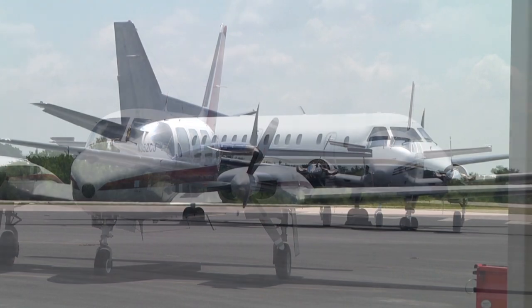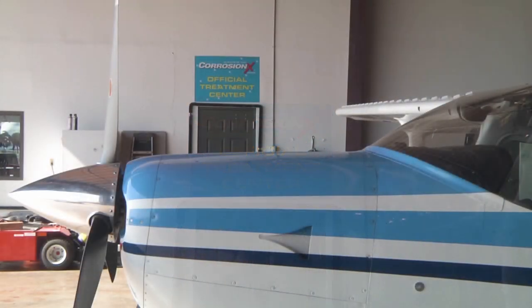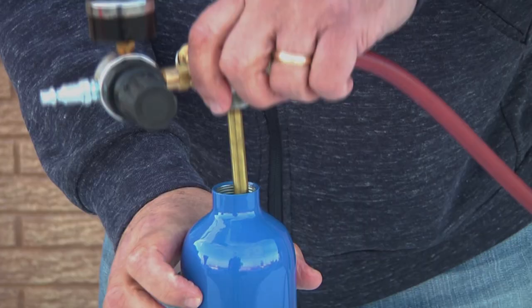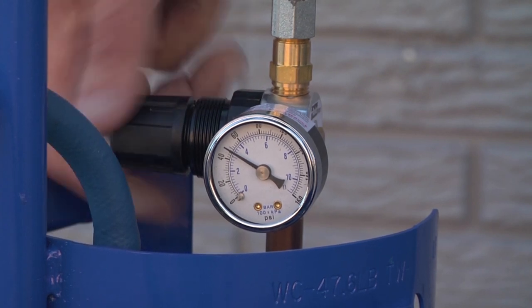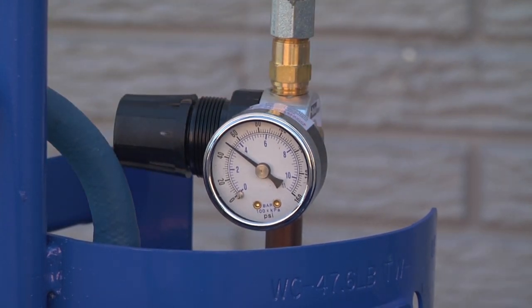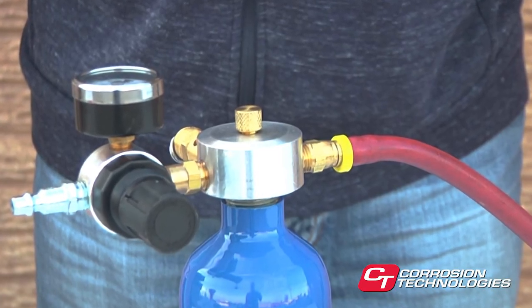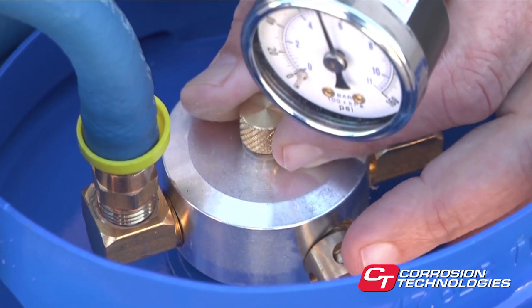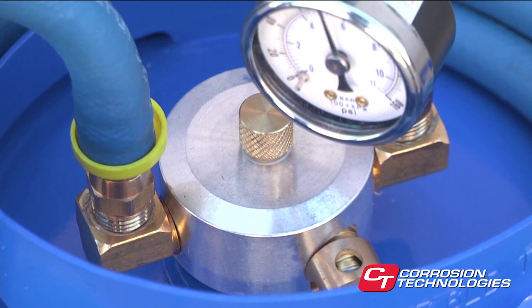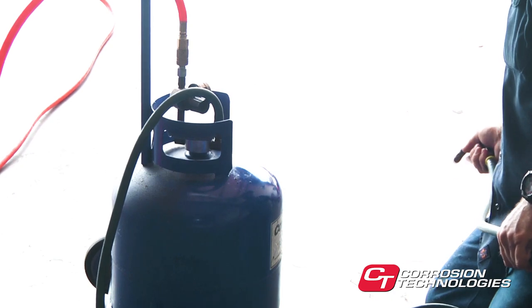For the purpose of this particular video, our demonstration will be on an airplane. However, these same techniques are applicable regardless of what type of vehicle or equipment you may want to treat. To operate your Handy Spray system, simply fill the tank, attach shop air, and adjust the regulator to approximately 80 psi for spraying CorrosionX, and you're ready to go. If needed, you can adjust the volume of the spray by turning the knurled brass adjustment screw counterclockwise for a coarser spray and clockwise for a finer one. Be aware that when you adjust the spray volume, there will be a slight delay before the change in volume is reflected at the spray nozzle.